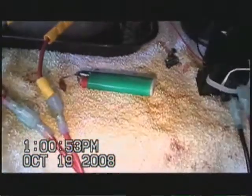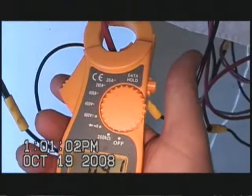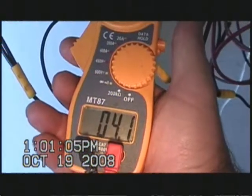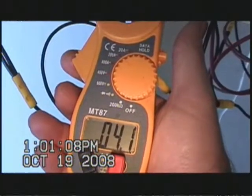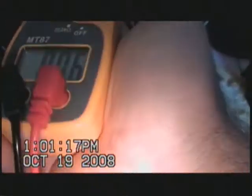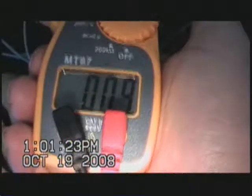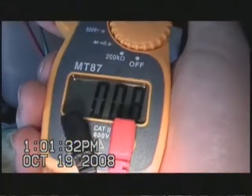Overall production for this straight DC tubes: I'm running 4.1 amps. See how it jumped up almost 2 amps — I think it was 2.5 amps last time I checked. That shows the heat — not very good gas production. Each tube is running about 0.8 to 0.9 amps.